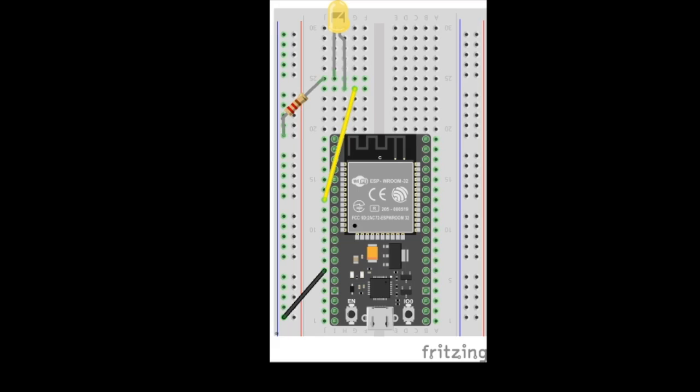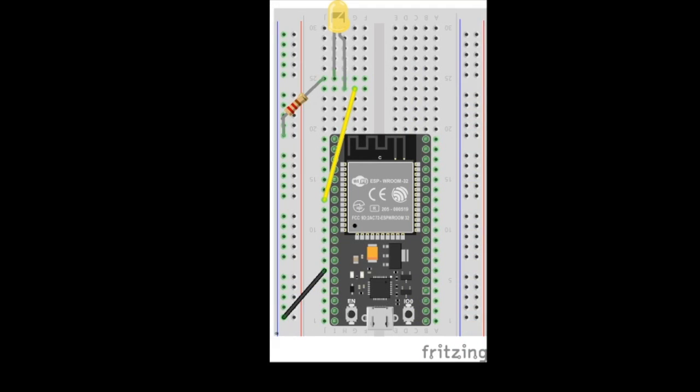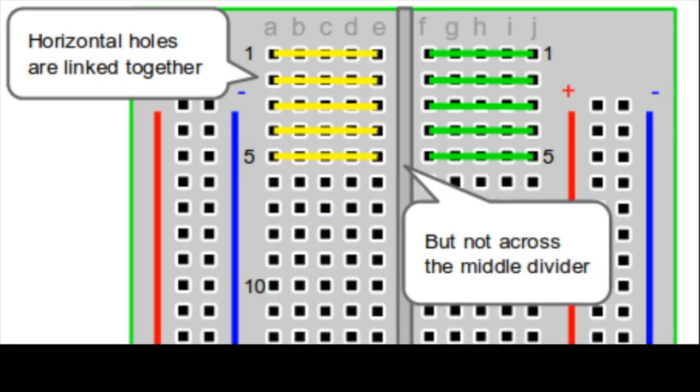We have a ground pin, and also we're using pin 32, which on the breadboard will be 13, but it's GPIO 32 on the ESP32. And we're using this ground pin on the left. That's going to go up to an LED and through a 220 ohm resistor back to the ground. I'll leave a link in the description for a good site that shows how the breadboard is laid out and what pins are connected together and which ones aren't.